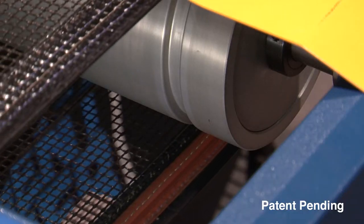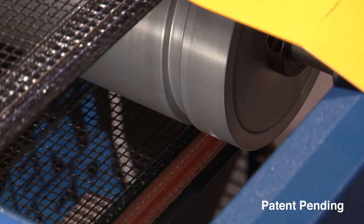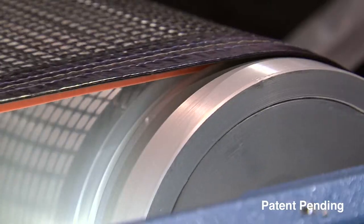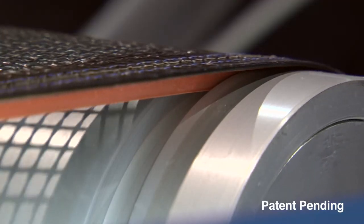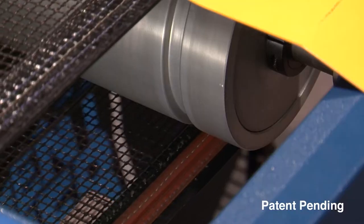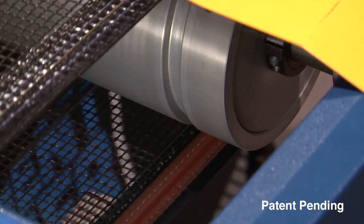Fusion's reliable heavy-duty DC motor powers M&R's Teflon-coated fiberglass Patriot belt with the SureTrack roller system. The red silicone guide, stitched along one edge of the Patriot belt, rides in grooves machined into the large anodized aluminum SureTrack rollers, keeping the belt where it belongs. It's the most precise dryer belt tracking available.